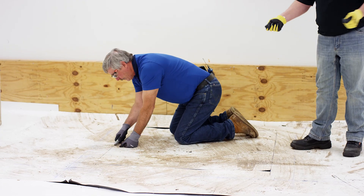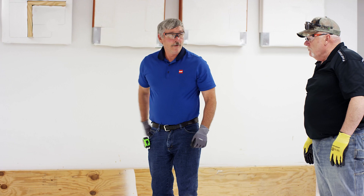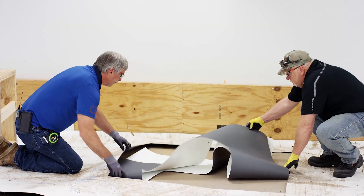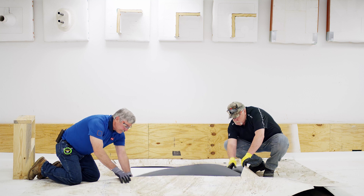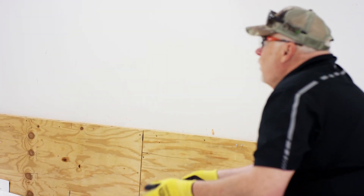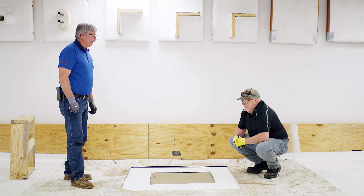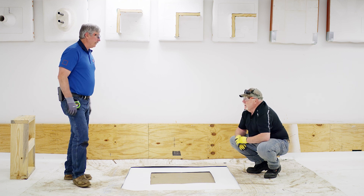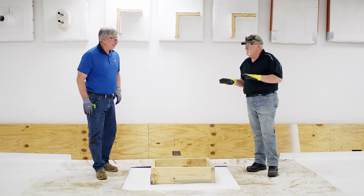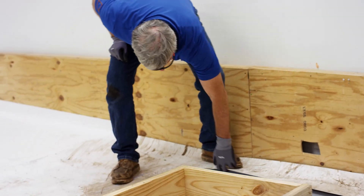When Wally's done cutting, we're going to take that piece and basically throw it away. Now we take the new membrane and slide it underneath — we want to fold it and try not to get it dirty. Now, this technique works on a rhino bond, mechanically attached, or ballast system, but not on a fully adhered system. Why? Because it's glued down. The piece we pulled out, we're going to start by replacing the insulation, then reset our curb. Now we have fresh, brand-spanking-new membrane right here.